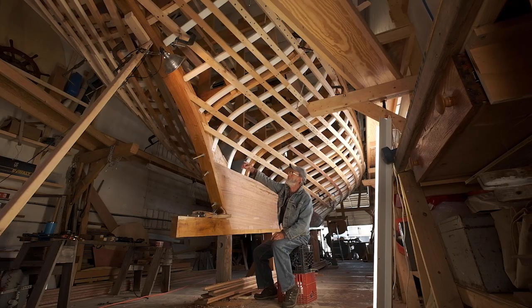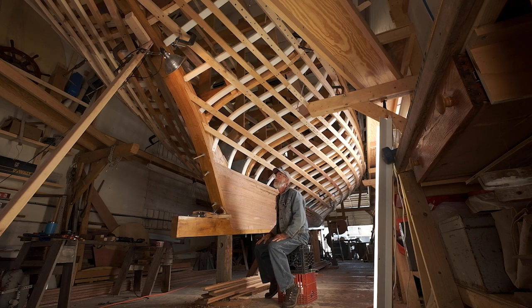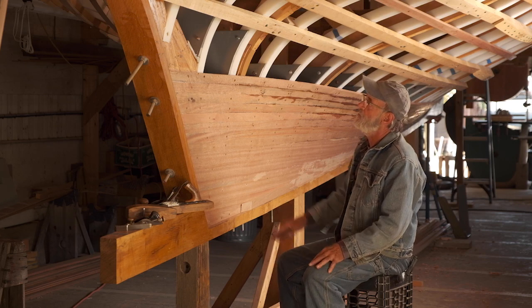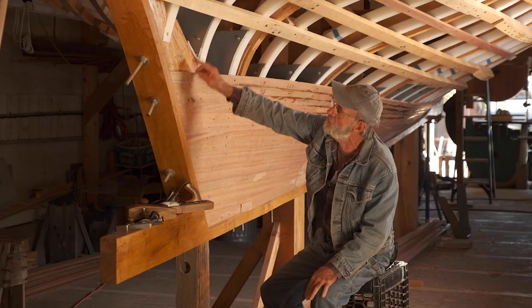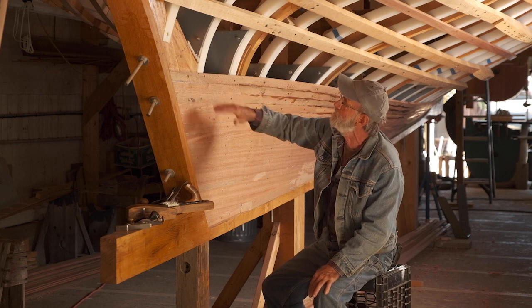You've got to drill a hole out for the shaft through the horn timber or through the stern post, and then a hole up for the rudder post. There's quite a bit of work going on back here. Here's one of the floor timbers — the plate-style floor timber bolted to the side of the frames. This bolt right here bolts that down to the center line.